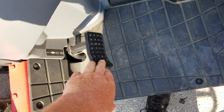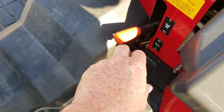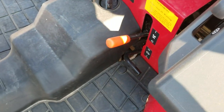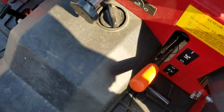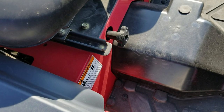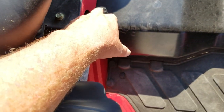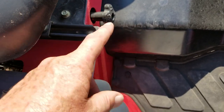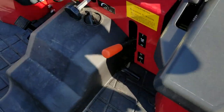You've got your clutch over here, brakes are over there. You've got your four-wheel drive on and off, and your differential lock. So if you're ever in a sticky situation, drop your heel on that — it gets all the wheels and gears spinning at the same time. It's easy to check your oil and your fluids in the back on this one. This also controls raising speed or slowing down the speed on your three-points whenever you are dropping it — same thing with this one.